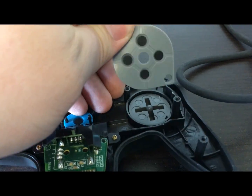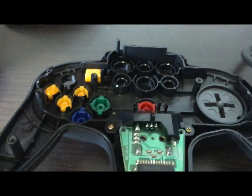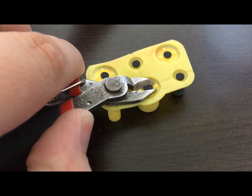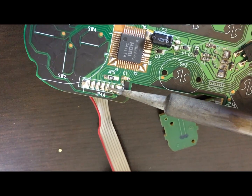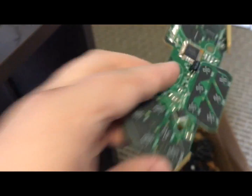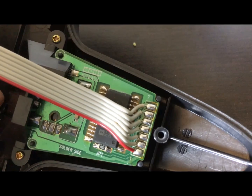We should take out the buttons and pads before we do anything. They're mostly higher-quality, or less-used versions of their N64 counterparts. We'll start the iron for later, but want to neuter the conductive pads of the LodgeNet buttons so they don't short out on the PCB. We're going to de-solder the joystick from the LodgeNet board. Hori nicely labeled the pins on the joystick board — that's going to help us later.